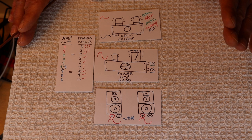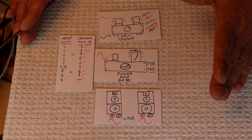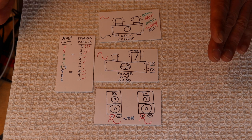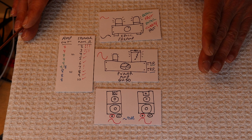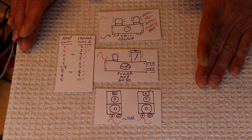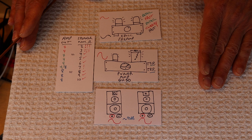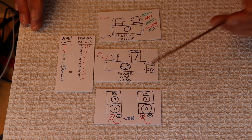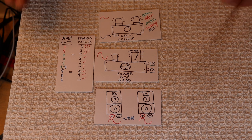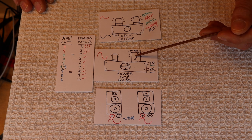Can you listen at a normal listening level? Maybe. To figure out whether it's safe, do a little test: measure the temperature of your power transformer. If it's tucked inside the amp, find a safe spot on the chassis close to the transformer. Do not go inside a live chassis to measure it. On our kit monoblocks, the power transformer is right on top — out in the open air where it can ventilate naturally. You can easily measure the temperature.